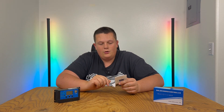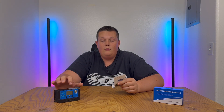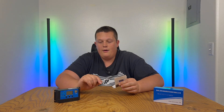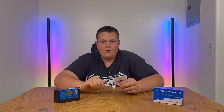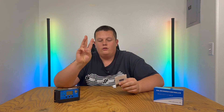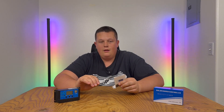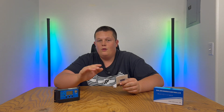The third option is if you set it to 0 hours — that means it will provide power from dusk to dawn. Right as the sun sets and the solar panels stop producing power, it will turn the load on and run whatever you want until the sun rises again in the morning and the solar panels start producing power. Those are the three options on the work mode screen — all based around when the sun is no longer producing power.